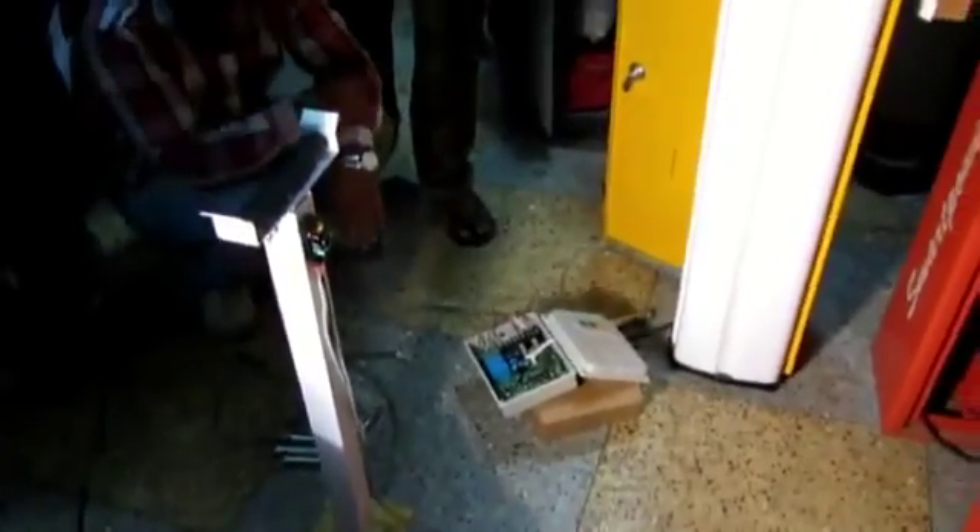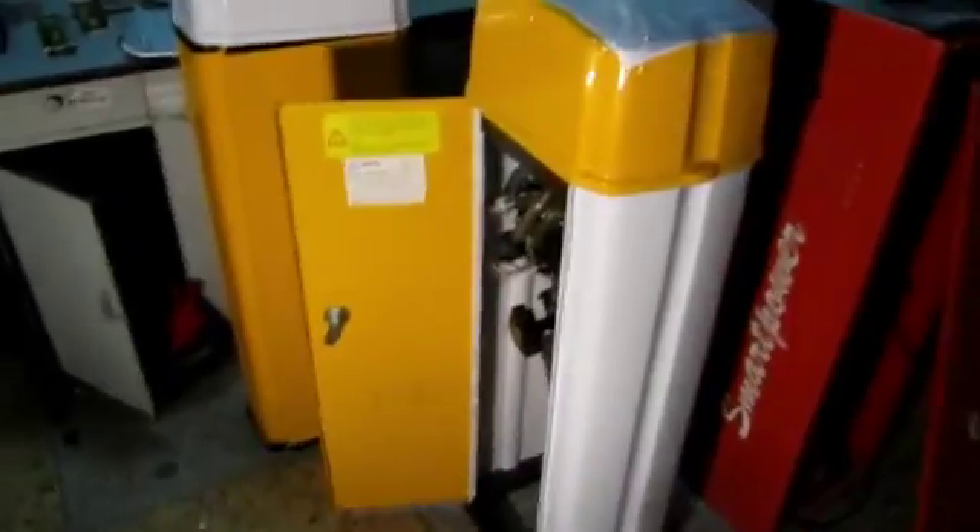This is the photo sensor operation. I open the boom barrier and then close again. If somebody comes in between while the boom barrier is closing, it will reverse and open again. The normal distance between the photo sensors can be five to six meters. Thank you for the successful demonstration of the Smart Power boom barrier 406 type.